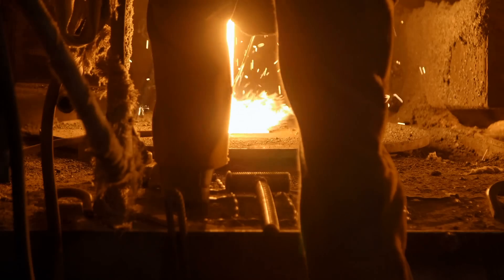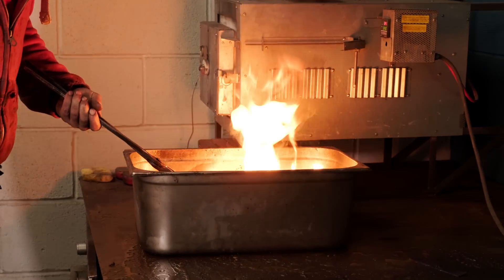There is a big drawback with quenching into oil and that is what is known as soft spots. Industrially, if you get a very big block of steel and put it into plain oil, that oil is red hot — well above the boiling point of the oil — so the oil starts to boil. You can get a bubble of oil vapor that sticks to the side of the block. That stops fresh oil from getting onto that hot metal, so you're actually insulating that part of the metal. You might have a sheltered spot where the oil is not moving quickly and a vapor block builds up — that part doesn't cool very quickly.